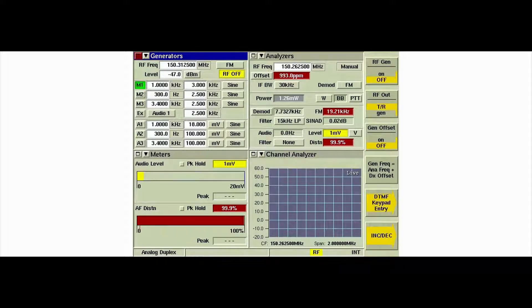Turn on the radio and place it in test mode by pressing the Home button five times within 10 seconds of the self-check completion. Once the radio is in test mode, press the Home button once more and set the display to read 4CSQ.